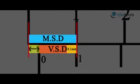We move the zero until the first mark of the Vernier scale coincides with the first mark of the main scale. Now we can firmly say the displacement of the Vernier zero from the main scale zero is 0.1 mm, because the first mark is 0.1 mm shorter than one main scale division. Moving further so the second mark coincides gives a distance of 0.2 mm between the two zeros. Similarly, when the tenth mark coincides, the distance is 1 mm.